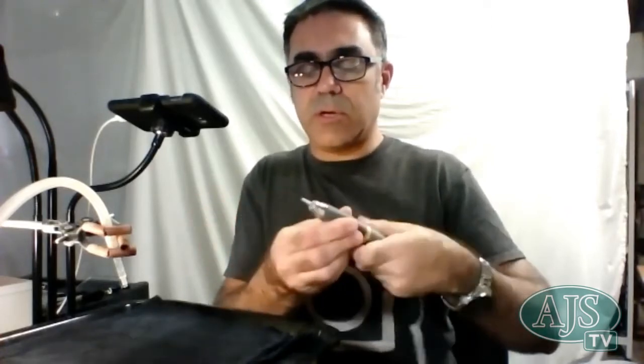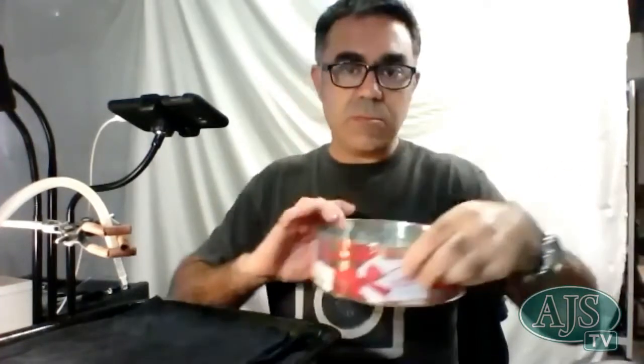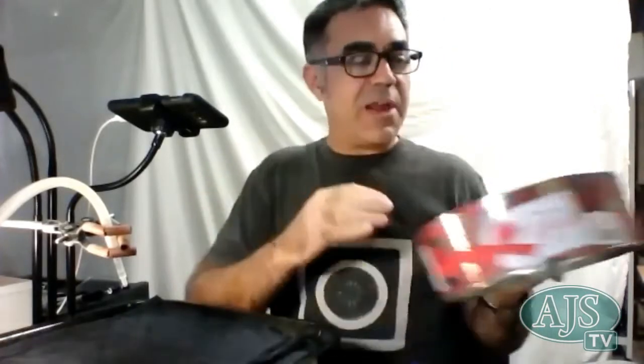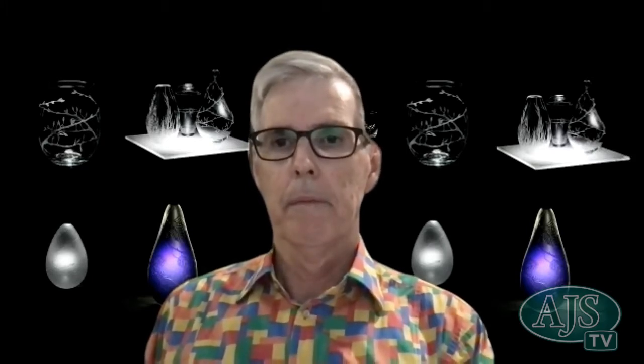In the handpiece, the beauty of this one is that the collet clicks open, and I can just lock it again and quickly change burrs. I have my little selection in a tin in some foam, categorized according to size, especially the ball burrs, which I work with a lot. Different sizes and profiles will give you different cutting shapes. I've collected some of those over time, but there are also simpler sets you can get,